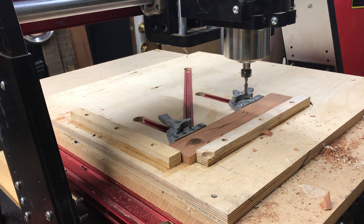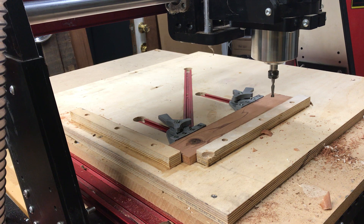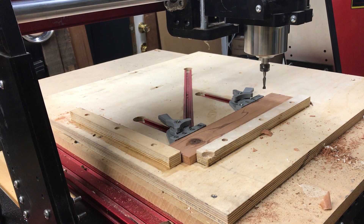This looks pretty good. Notice my spindle's off, my vacuum's off — I'm not worried about any of that. I'm just worried about the program. This is how we proof the program before we actually run it on the machine.